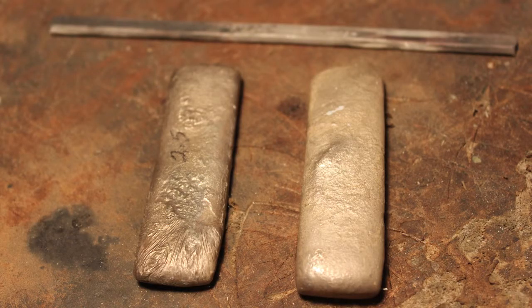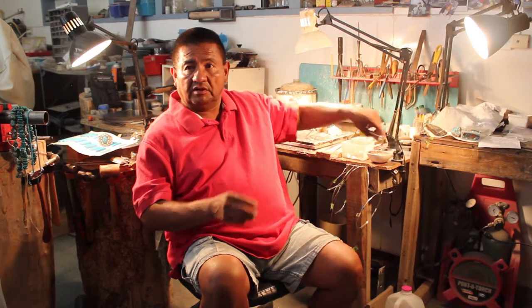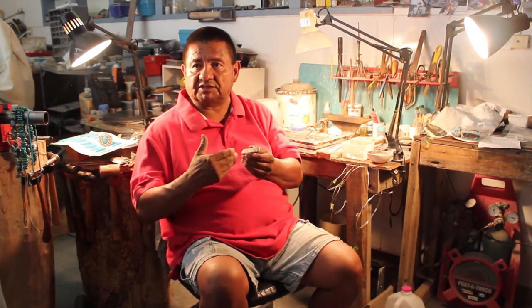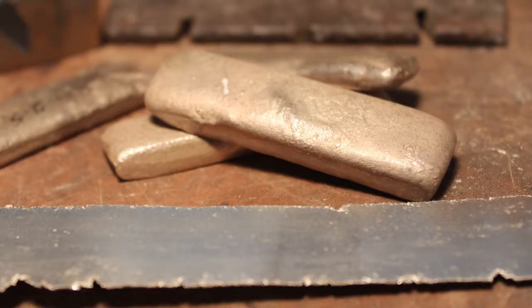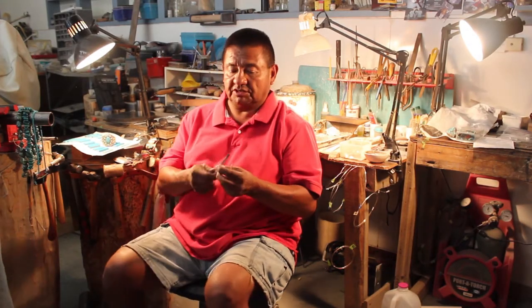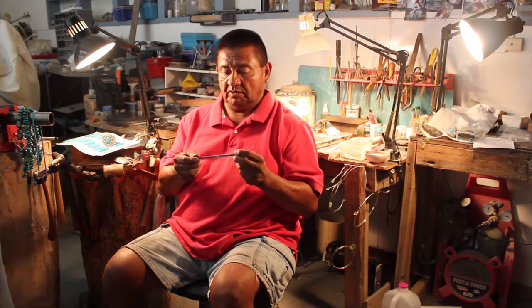Once we get that done, we roll them out or shape and form them. We want to keep them in that form because there are different types of work we do. There's forging — for example, we forged this out a little bit, heated it up, and tried to get all the impurities out to at least get back to sterling silver quality or better. In our case, we're usually doing a little better — maybe 96 to 98% silver versus sterling, which is 92.5%. We worked on one this morning where we actually took silver from an ingot form and made a long bracelet shank that we'll be using later on.